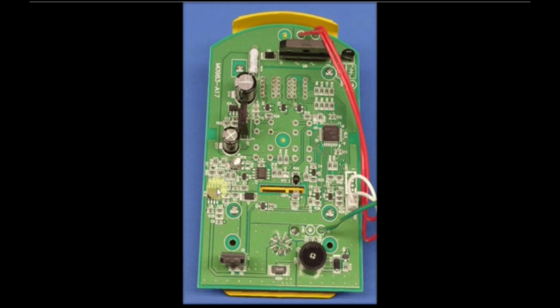OP77, I think it's either this one or this one, and that is probably used for the temperature measurement with the thermocouple integrated in the tip. And so this is a totally different circuitry, and here with this shunt resistor we already know how they manage to detect a reverse inserted solder tip, which of course gives a short, and I will link in the video from the fellow video blogger who did this very nice teardown and test and review of the original Hakko station.